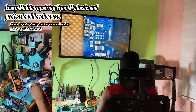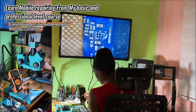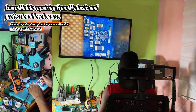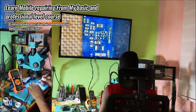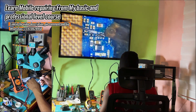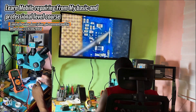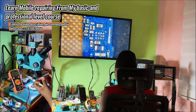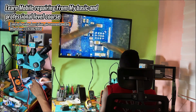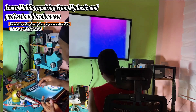After jumpering, I tested to see if there was still a short — and there was no short. This confirms that the OVP IC was causing the short. To complete the jumper, I just linked those two pins to ensure continuation in the line — connecting the voltage path from the inductor to the large capacitor on the other side. I tested and everything was okay.